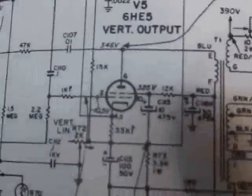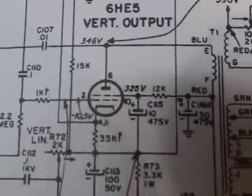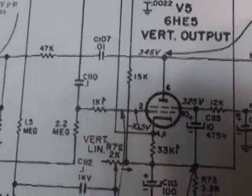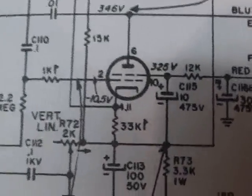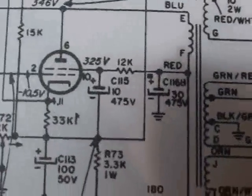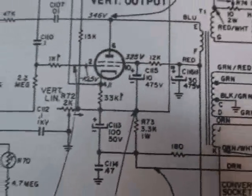Let's take a look at some voltages. The plate voltage should be 346 volts at pin 6. The control grid should read minus 10.5 volts — that's coming from the feedback loop from the oscillator. We should check it anyway since it's going to the output tube. We also want to check pin 10, which should read 325 volts. There are a couple of electrolytics in the circuit — those are definitely attention items — including one at the cathode rated at 150. Those lytics do need to be checked.